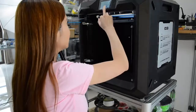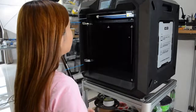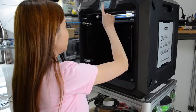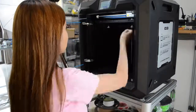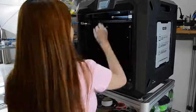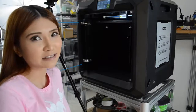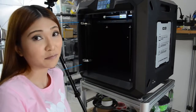Now just tap OK to go to the next leveling point. Unscrew the same thing — unscrew the corresponding nut under the platform clockwise until you hear a steady beep. I hope this time I don't need to unscrew two at the same time. So it's done — it's okay, but I am not totally happy about it. I would consider it assisted leveling rather than auto leveling. I will talk to FlashForge about it and see what they can do. Maybe they can improve it a little bit.